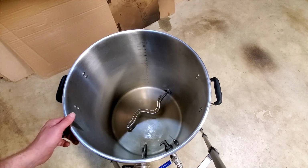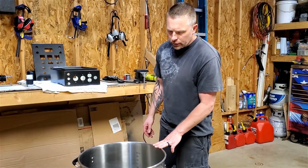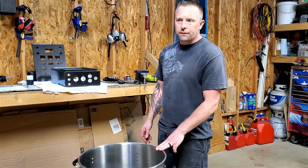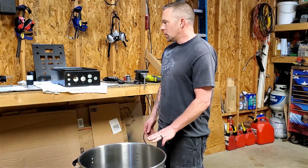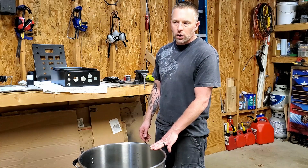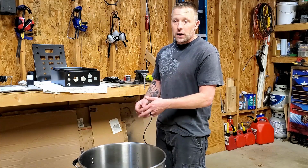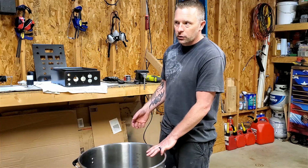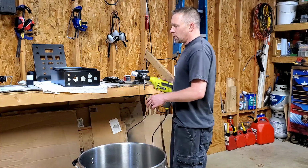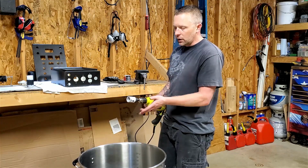I'm going to go ahead and clean and do a leak test on everything before putting this thing up and start on my cords. I do want to add real quick on this one too. It takes an inch and 5/8 cut out or knockout, however you want to do it. Knowing that my knockout tool wasn't going to work, I was past the point of no return on the last one because I already used the Unibit to be able to get the bolt in for the knockout kit. So I had to use a Unibit to stay centered. But on this one, I knew that wasn't going to work, so I just went ahead and used a hole saw. Used 1.5 inches and then actually just filed that last little bit for a real nice snug fit, and it worked like a champ.